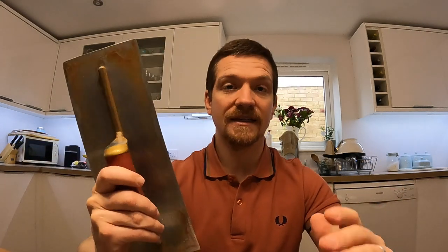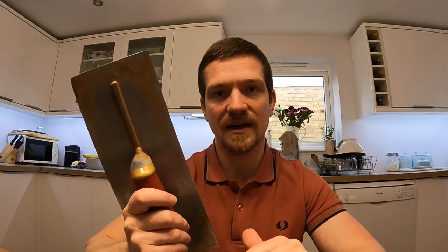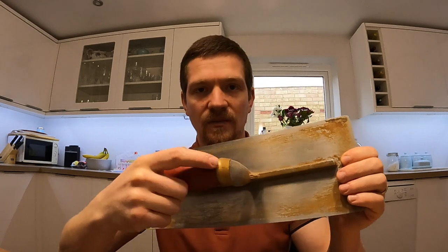Moving on, the next thing is the base trowel. If you didn't watch yesterday's video, make sure you catch up, because we talked about all the different types of trowels and their purposes and when you should be using them. This is where I think you should really start spending a bit. The one I would recommend above all the rest is the Marshalltown Permashape — you'll see me use this all the way through my videos. It's the one with the gold band. It's stainless steel, which is good for beginners. I'm actually in the process of getting a carbon steel trowel, but if you are a beginner, I do recommend a stainless steel one because it won't rust.